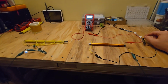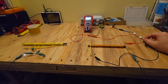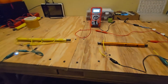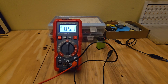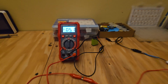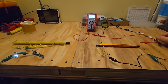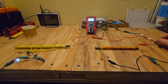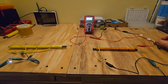And I can show you the tuning process again with the potentiometer. When I tune it into high power mode, we'll see it consume more power. As you see, we are consuming 5 milliamps. But the interesting thing is there was no increase in brightness on the light when the circuit consumes 5 milliamps versus when it consumes 0.3. So I'm going to fine tune it now.